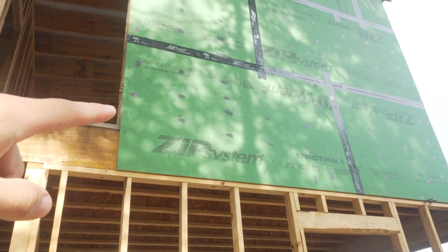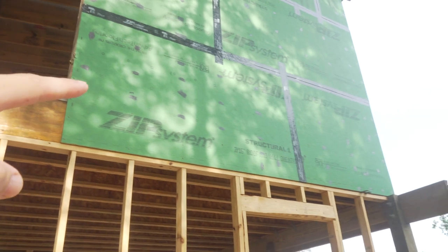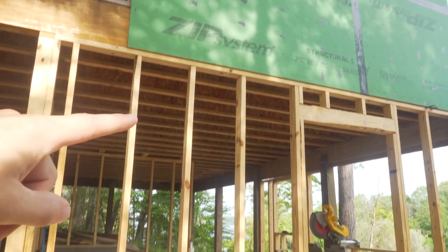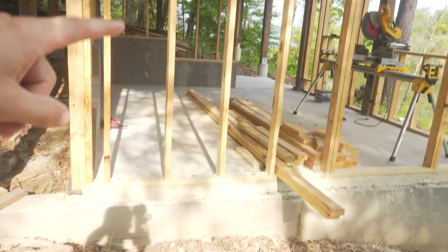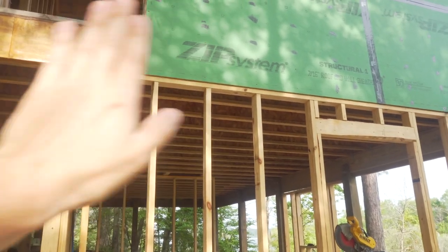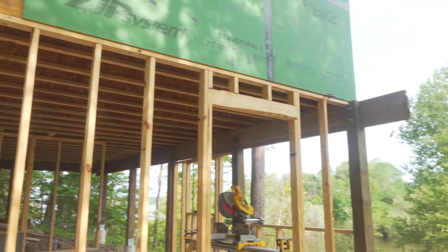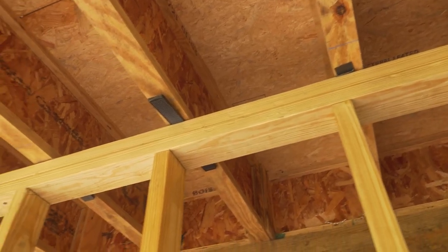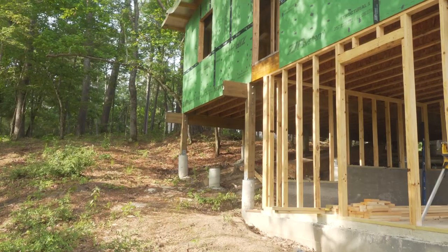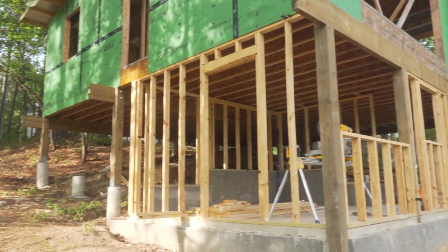My plan here is to cut this sheathing back some, and I want the sheathing to overlap from up there down to this lower floor — just so this will all be anchored down here a little bit better. It'll also make the house a lot more rigid this way. I just need to secure this top plate in a few more spots and then we should be good to go for putting some sheathing on.